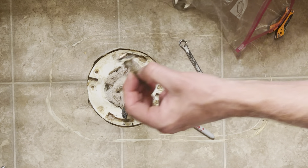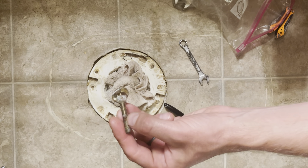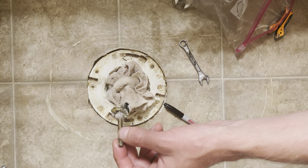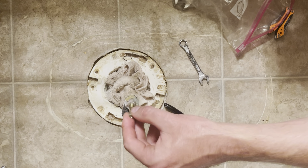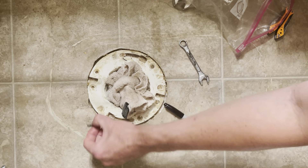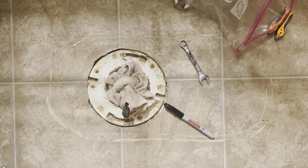These new ones — I like the older ones because they had a washer and a nut and stuck in place pretty good. But the new ones just get a plastic lock washer. The thing about it, particularly with toilets, is you don't over-tighten anything. That's really the only mistake you can make. These new ones have just this locking plastic washer that, once the toilet is seated, will suck these up — the bolt will be locked in there, and that nut will secure it in place so the toilet seat won't move.